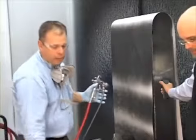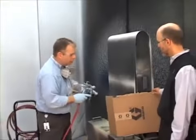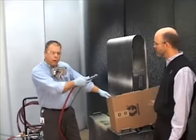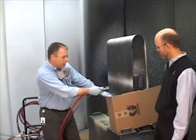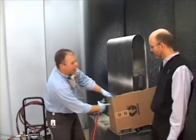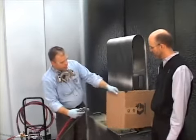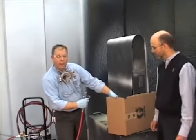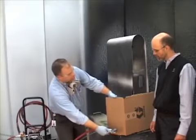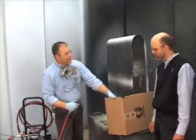A couple more things about technique — we're just going to use this cardboard box as an example. I want to talk about cornering and how we paint the corner. What you want to do on a corner is come parallel to the corner, right even with the corner, and follow down. That way you're hitting the corner and out at the edges. On a square surface like this, once you do the corner, you come over to the square surface and do what we call banding — come across the top, do the sides, back across the bottom, up the other side. So we've created a box, or we've banded it.